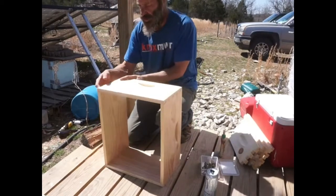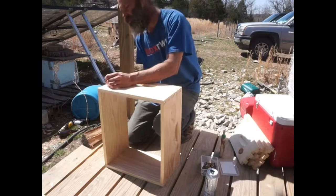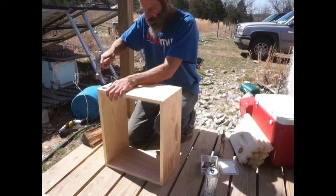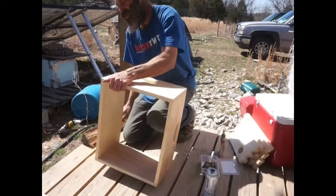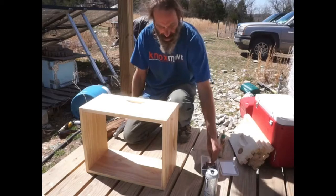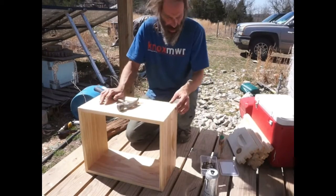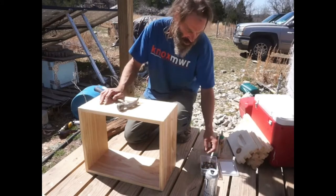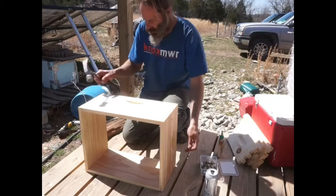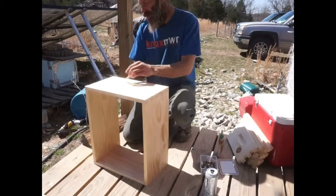And often the best way to clamp them is to put a nail in on the side where it's lifting up, push down on it, then go back and secure the other ones. If you have an air nailer and an air compressor, this probably goes a lot faster. I'm just using these short little 6-penny nails because that's what I have laying around and they work well enough.